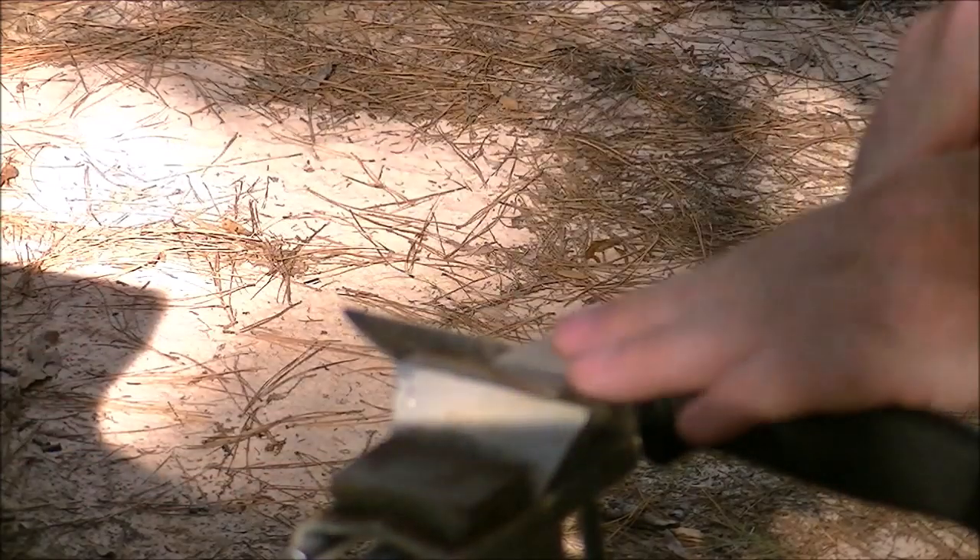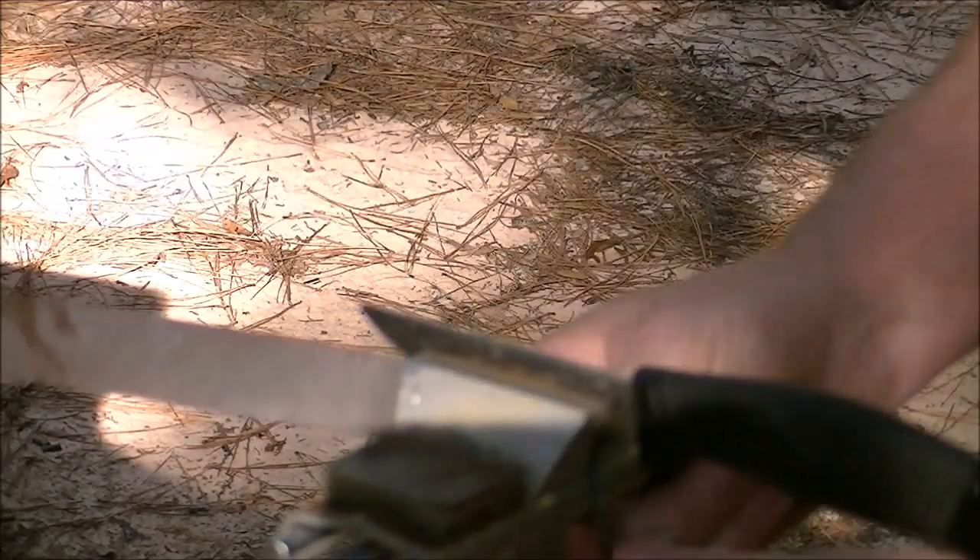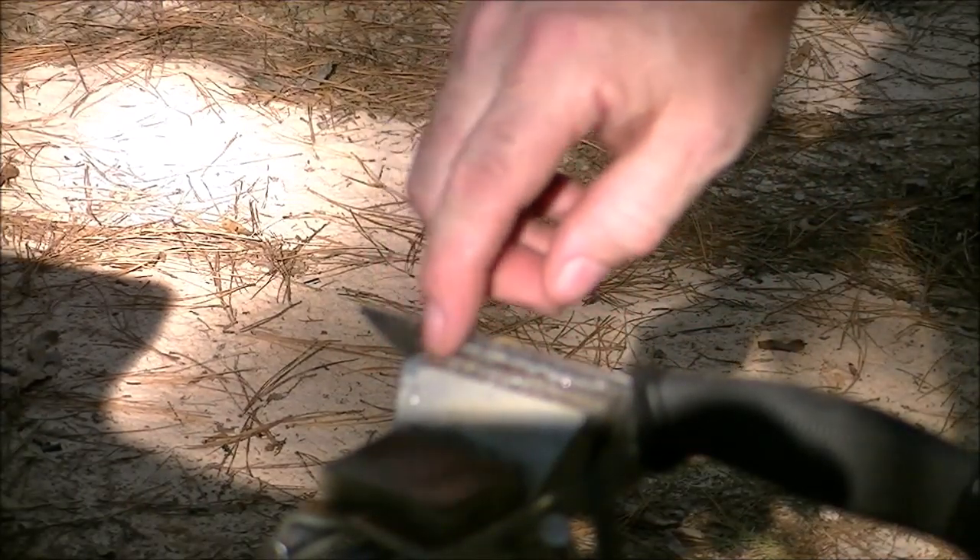I'll clamp my little hand vise up on the edge of the bench. I'm going to take the file and start with the coarse side, going across starting at the back and straight up that blade, keeping the file flat. Get long strokes and go all the way to the tip. When I pick my finger on that proper side, I feel a little raised lip — that's what I want. More back here, definitely more.